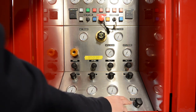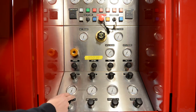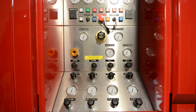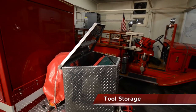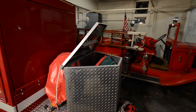After every filling operation, you should ensure that the onboard banks are completely full. We fill them by opening the valves and running the compressor. The high-pressure hose reel is located in the front of the trailer and is used for remotely filling SCBA tanks. There is also a toolbox mounted on the front of the trailer containing miscellaneous tools to aid in the filling operation.